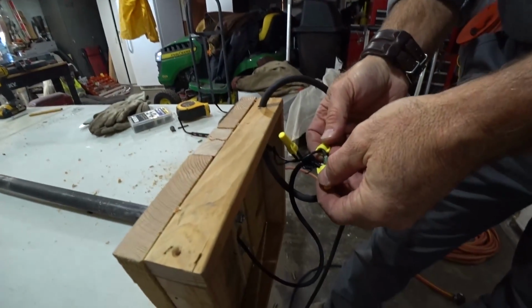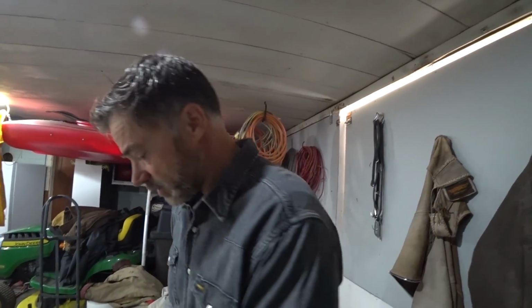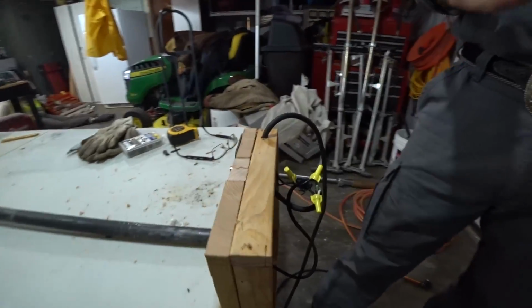So whenever you get an electrical appliance at like Home Depot or a hardware store, and you're wiring it into your household current, you're going to have to make a junction somehow. And this is always how it's done with wire nuts. The wire nuts will always come with any appliance like bathroom lighting, ceiling fans, or whatever it is, so this junction is very common. A lot of people will take electrical tape and tape that up, so there's no chance the wire nuts come apart. But make sure those wire nuts are really cranked down, and it basically screws the wires together and holds them together like that.